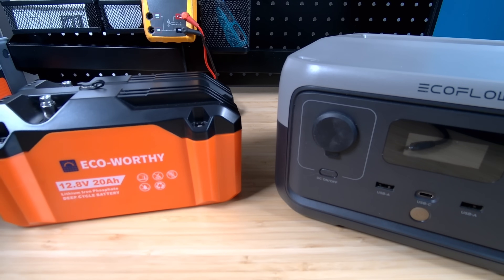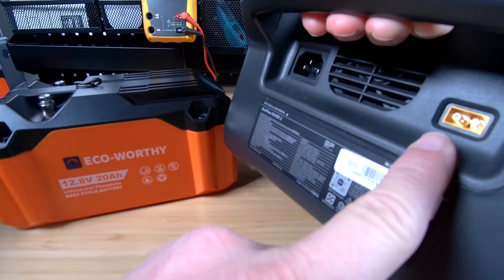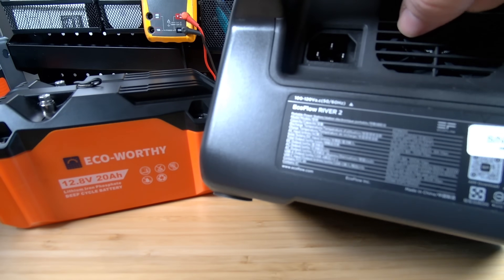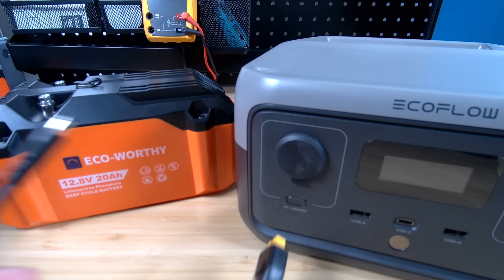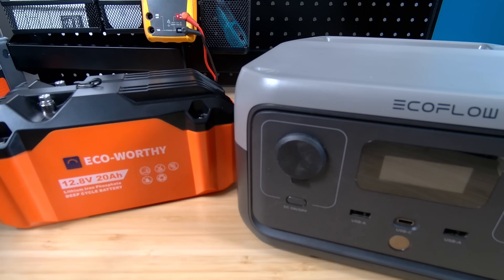As soon as I saw this output port, I figured there's got to be a cable that converts that to something else — and of course there is. If you've seen other videos like this, you know that you use the solar input on your power station to bring power into it. You want to make sure you check the voltage and current requirements of that solar input, because there's an MPPT controller in there that wants certain voltages. On the back here it shows 11–30 volts, 8 amps max, or 110 watts max. So we should be able to get about 8 amps from this 12-volt battery — around 100 to 110 watts going in. To do that, I found the exact cable: a 5525 on one end and an XT60 on the other. So if everything goes as planned, I plug this in here, I plug this in here, and this starts charging.